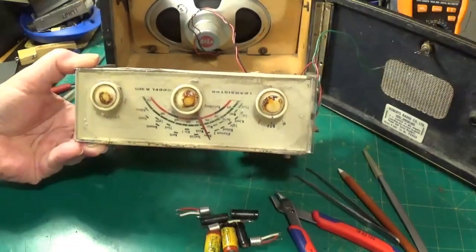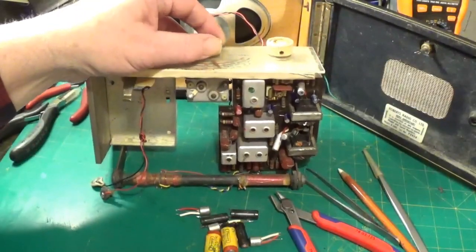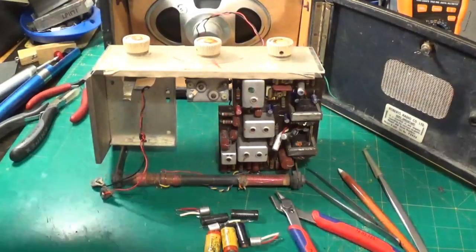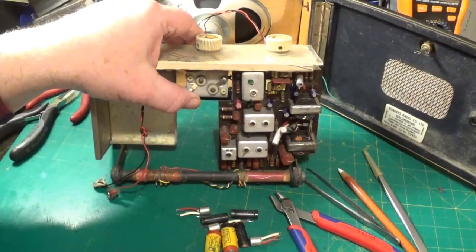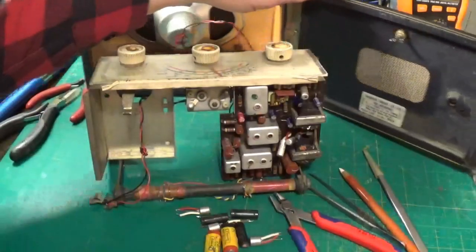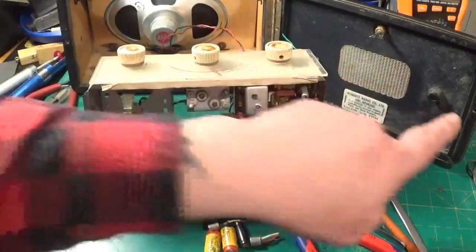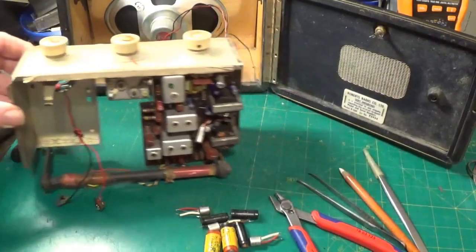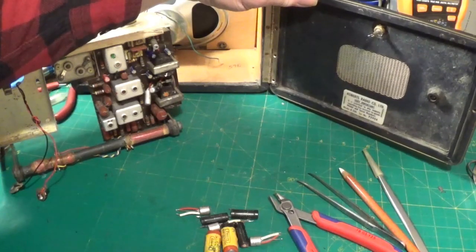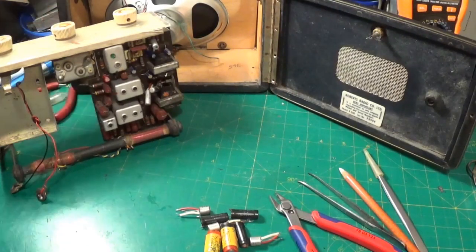What's left to do? There's obviously a major cleaning job ahead, and the most pressing thing is to secure this tuning capacitor, which is wobbling around like Mr Wobble — that's just the rubber grommets gone. Take the knobs off, take the dial off, and I think there are two sets of rubber grommets under the dial face. Then we've got the job of cleaning the case, which is quite mouldy here and there. Mr Codesis has very kindly sent me a new catch, which goes there and secures the back panel. And there's a bit of woodwork to do — not having the catch has meant the screws have sprung a bit, so that's just shoving a matchstick down the hole with a little bit of glue and putting the screws back in. That'll work fine.